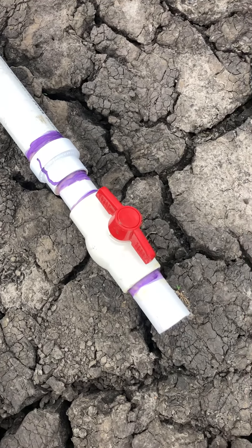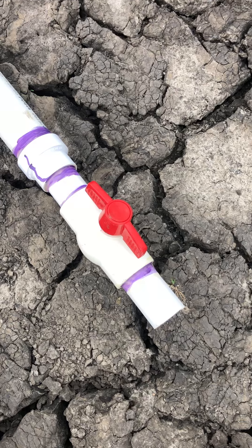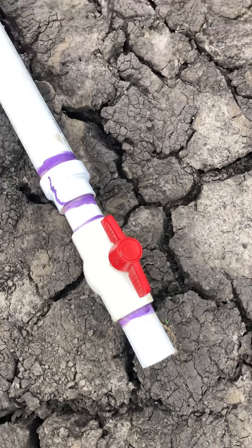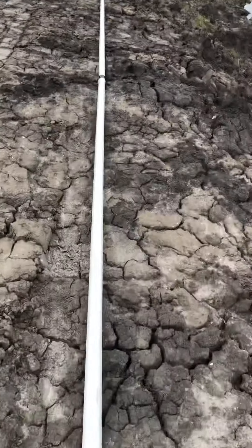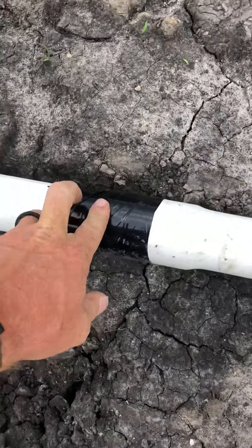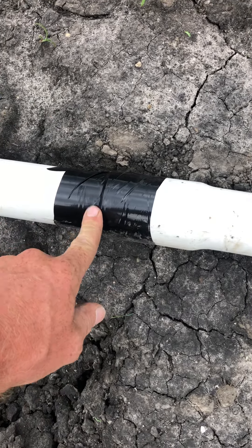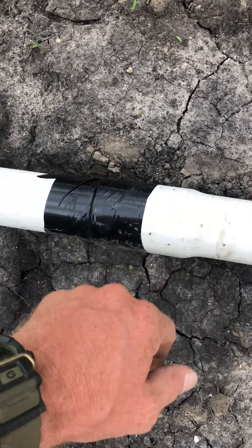Whether that's a rubber coupling or whatever fitting needs to be. Instead of gluing everything, I just connected them together without using any primer or glue. I use this tile tape — it's flexible, rubberized — I just wrapped it around and got it seated in there nice and good. Of course, the bell works better; don't use a coupling. No primer or glue is needed — I've noticed that in the past couple years doing this — just hold it together with tile tape.